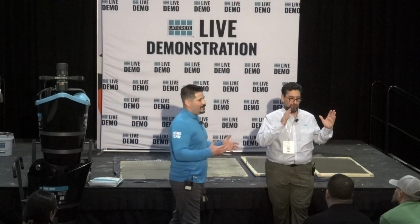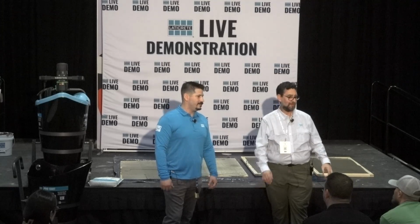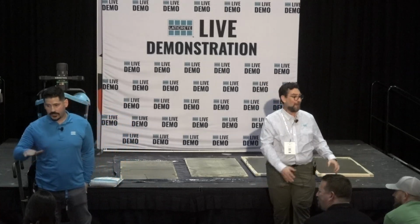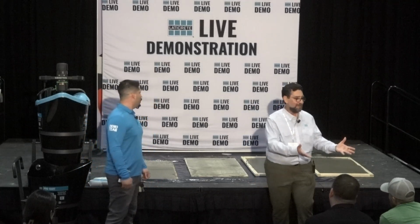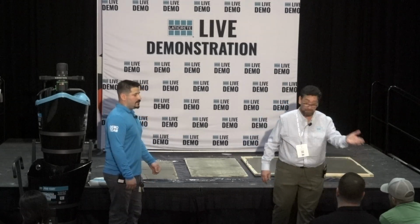It defeats the whole purpose of the lightweight. Why use the lightweight if you're adding an aggregate which has a higher density than even a standard self-leveling? That's the only reason that you wouldn't. Can you do it? Absolutely. It's a great what if.